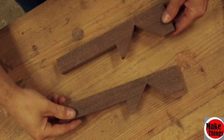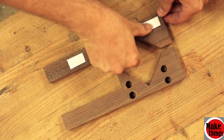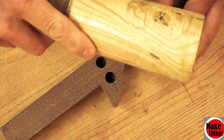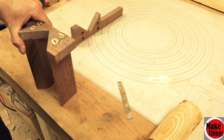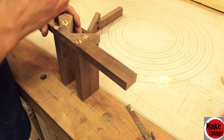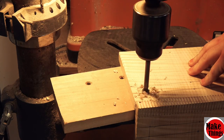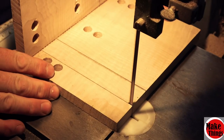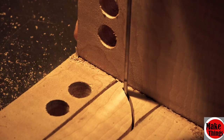Instead of just the dual base pieces, I decided to make more of a box. In order to make the box, I decided to once again use dowel rods as it is an easy joint. I made my first set of holes and used carpet tape to attach the second base piece, then transferred the dowel hole pattern using a Forstner bit to mark the holes. After drilling the holes I installed my dowels. I found it easier to hook the cradle over the side and drill into a piece of pine. I also made this cradle larger in both height and length. To address the problem with the stock being left in the air, I wanted the blade to be inside the jig, giving a little bit more support to the stock — this keeps it from tugging downward at the end of the cut.